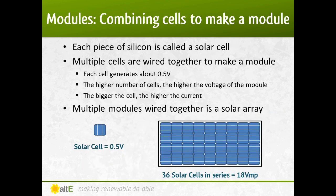Each solar cell generates about half a volt — that's not much for practical use. So multiple cells are wired together in series to create higher voltage, creating a solar module, commonly referred to as a solar panel. A typical 12-volt solar panel has 36 cells wired in series. The larger the cell is, the higher the current, so the cells of a 200-watt panel are generally two times bigger than a 100-watt panel.